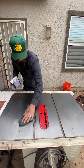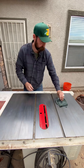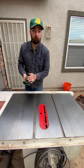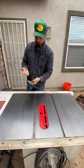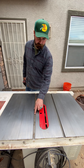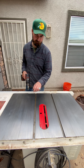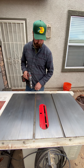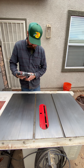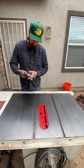Now that we've scuffed this up so much that our stains are pretty much going away, I'm gonna wipe all this off and then hit it with some acetone so that everything's very dry, and then we'll do our final sand. Be sure to wipe your hands off too, because you don't want your hands to be oily.